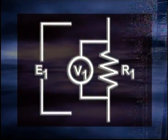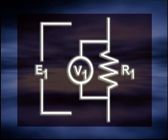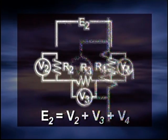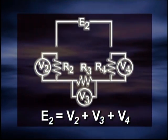Notice that although the currents divide through the different paths, the sum of the voltage drops of any one path always equal the source voltage. Therefore, the voltage across R1 is equal to the applied voltage, or 10 volts, as is the sum of the voltages across R2, R3, and R4.